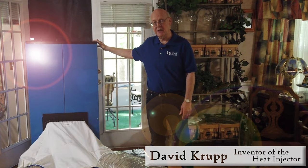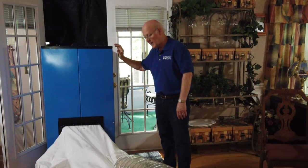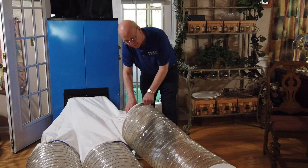In this video we're going to introduce the heat injector system that's designed to kill bed bugs with heat. Basically, the air will be drawn in through the air intake on the top, heated, and then discharged through flexible duct connected with fabric duct or fabric cinches that will shoot the air down through any one of these ports. You can control how much air goes down each one by restriction on any of the heads.